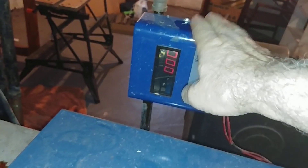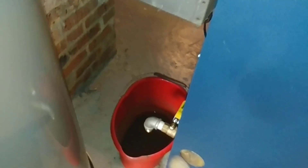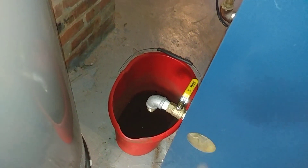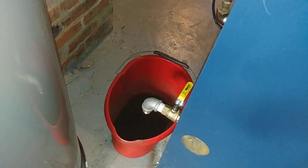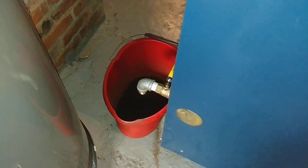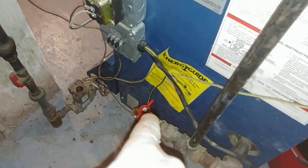This guy worked — no evidence of failure at this point, so we're going to leave it alone, maybe for another day. We took that plug out and put our lovely full-port drain valve on there. When we flushed it earlier with some cold water, we definitely got some Mississippi mud out of there, but that's the nature of the beast.